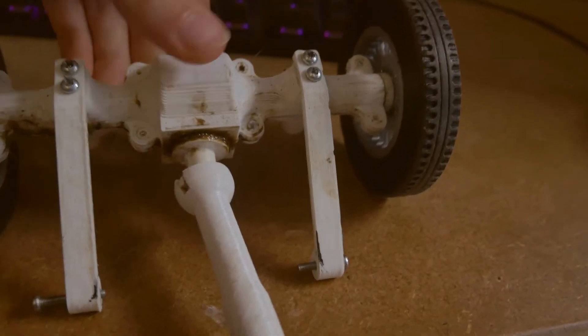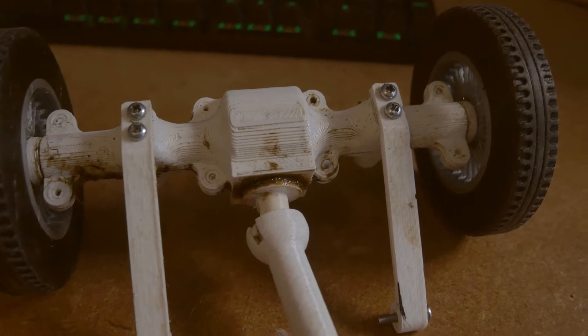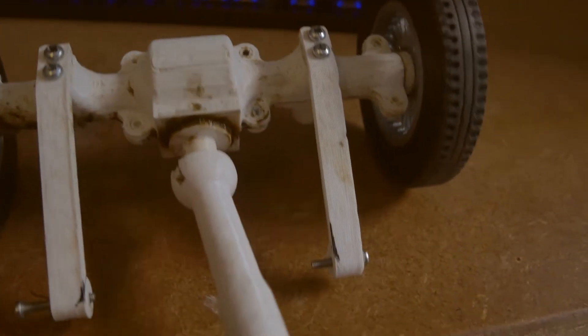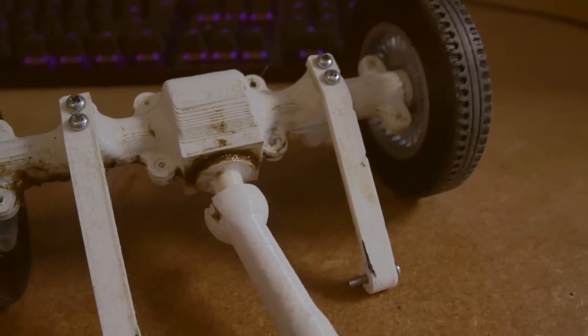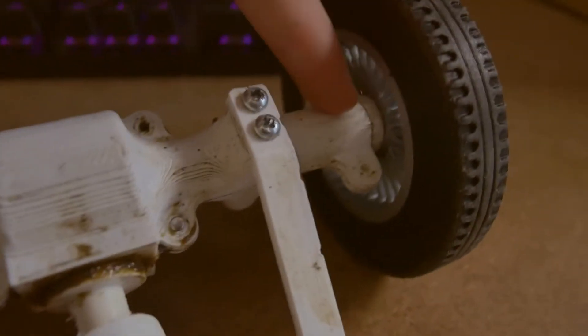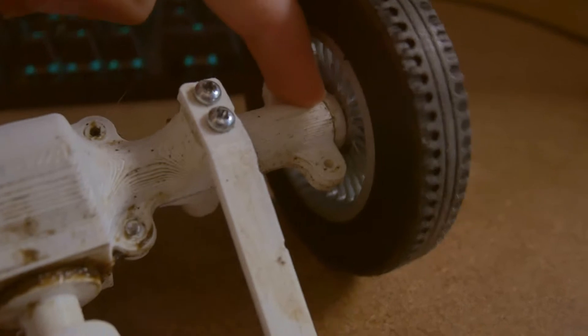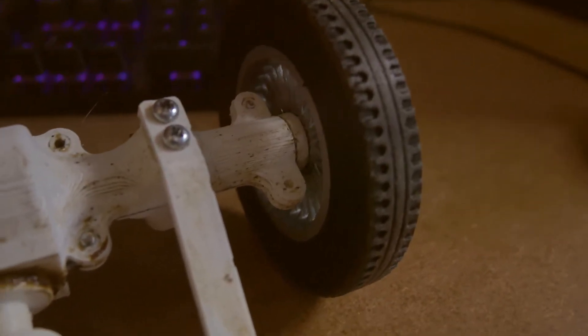So this is the back axle. It's a kind of similar design as you've seen on my big truck and my smaller truck. This is a very small design, completely different from the blue truck axle, and it actually works for an extended period of time. Instead of using a big brake disc style mounting system, this has got a blocker here which is the same diameter of the axle. And that stops the half shaft from being able to snap.